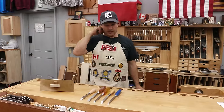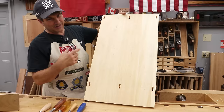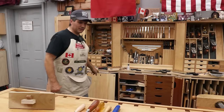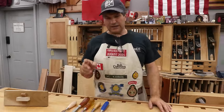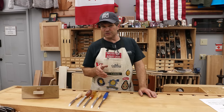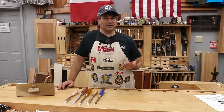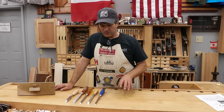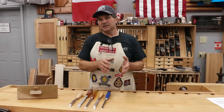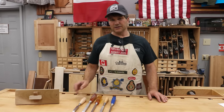If you're building a piece of furniture that doesn't have a whole lot of mortises to cut — for instance something like this, I've got three on the bottom, three in the top, and six on the other side — that's not a whole lot. The amount of time it would take to set up a jig or a machine to do these, particularly out in the middle, you could do them by hand a lot faster. And like planing wood, it's very satisfying to chop mortises by hand. When it's done properly with a properly sharpened chisel, cutting those little sections and seeing them come out is quite fascinating. I've done a complete video on cutting mortise and tenon — we'll leave a link below. But I want to share tips that may make the difference between this being easy and achievable, and help you discover why you haven't been able to get them satisfactory.